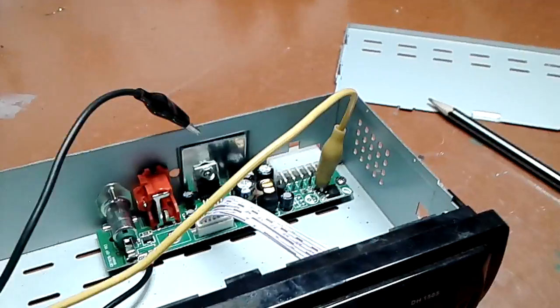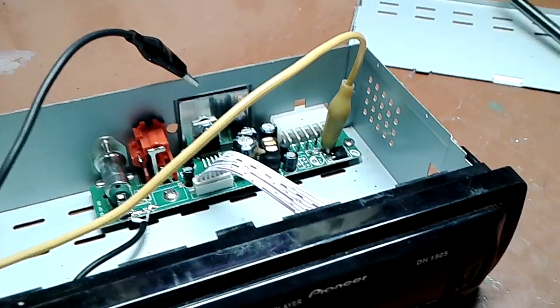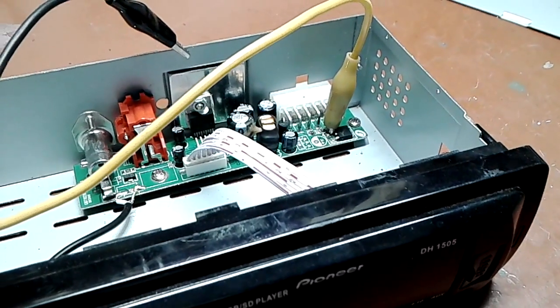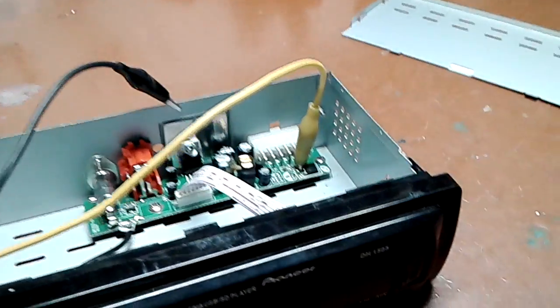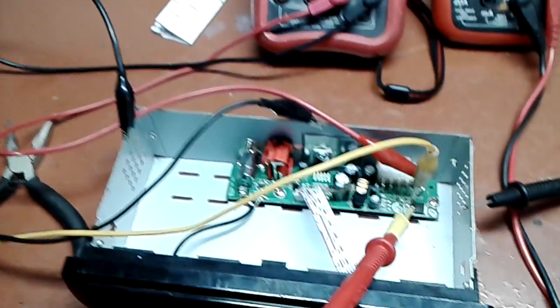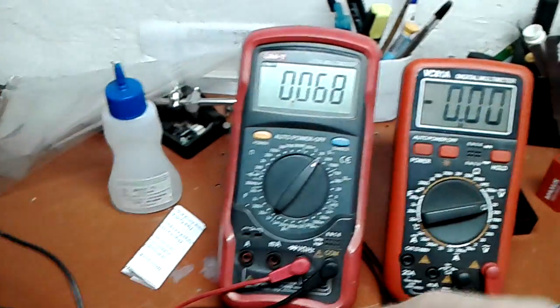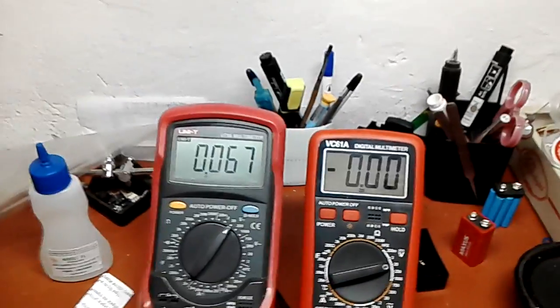And I connect a digital multimeter to the output of the regulator, and I will slowly turn the voltage up and see if I can spot the regulator behaving as it should. Let me do a little setup with two multimeters so you will see each and every voltage. Okay, here is the setup. This one shows the input voltage to the regulator, this one shows the output. Let me switch on the power supply,